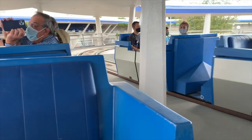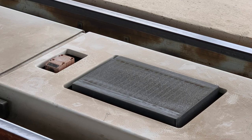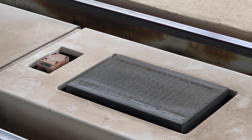Okay, so let's talk history for a brief moment. The first time linear inductive motors were really used in an attraction, it's not really a roller coaster, just an attraction, I believe was Walt Disney World in 1975 when they opened up the People Mover. Instead of like Disneyland, which had kick tires all over the place, Disney World opened up their People Mover with linear inductive motors lining the track, which works great because it doesn't care about weather, friction, anything else. It's still able to move those vehicles around just fine.